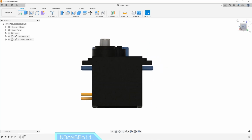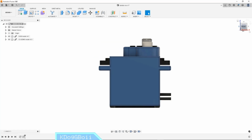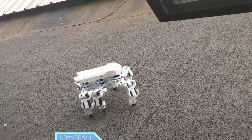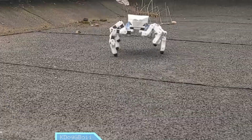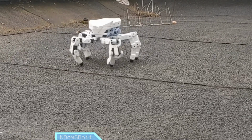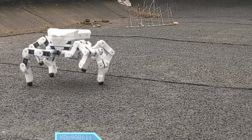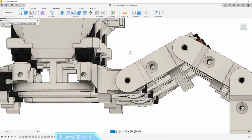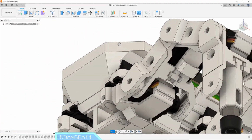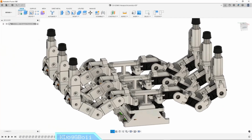The motors were 2mm larger than the SG90s, a small difference, but large enough that I had to redesign the whole robot chassis from scratch. This chassis redesign resulted in wobbly leg joints thanks to my eyebrow-raising mechanical ability. Not good eyebrow raising, I mean like, oh my god, I didn't realise it was possible to screw up this badly, eyebrow raising. I usually try to avoid including fasteners and 3D printed parts because I like making my life difficult. But this time, I swallowed my pride and included screw-on link retention plates to try and solve the problem.